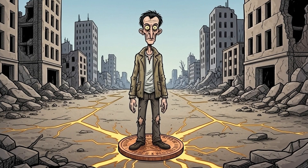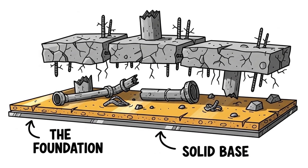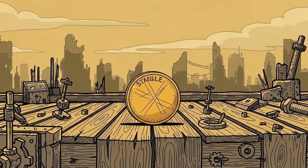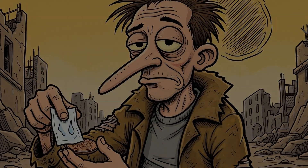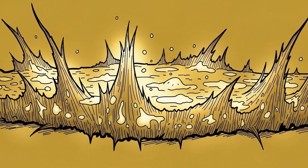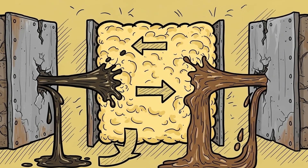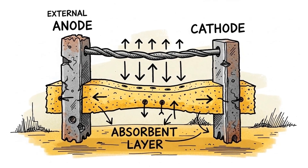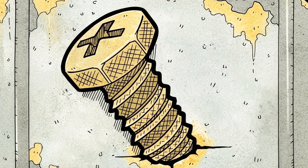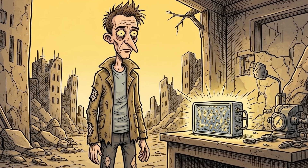Step 3: Start stacking your battery cell. Lay one piece of copper metal down first — a copper coin or piece of wire works well. This forms the base, your first electrode waiting for action. Step 4: Place an acid-soaked absorbent square on top of the first metal. Make sure it covers the entire surface — this layer separates your metals and holds the electrolyte right where it's needed. Step 5: Put the second type of metal — a zinc screw or piece of galvanized metal — on top. This completes the metal sandwich: copper, then acid, then zinc. This is your single voltaic cell.